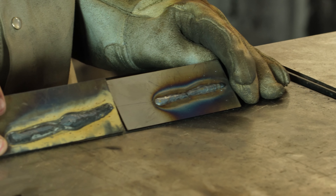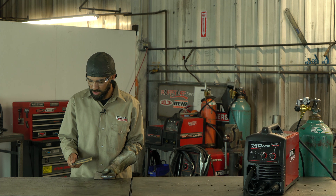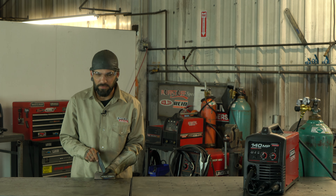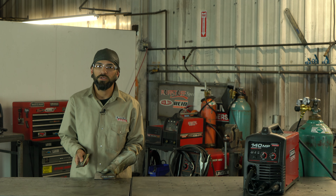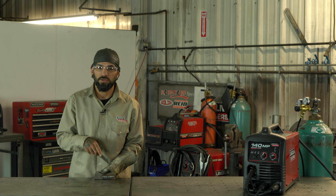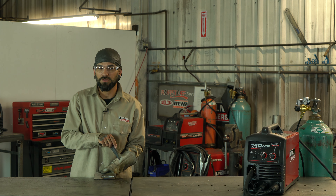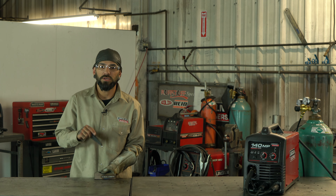The big differences are in appearance. These aren't bad welds — you can get a pretty good-looking weld with gas. Appearance-wise, a lot of people prefer this look over the flux core appearance. Remember, always weld in a ventilated area. Just make sure your fan isn't blowing directly across the surface of your weld, because that's when you'll start getting porosity.